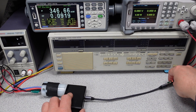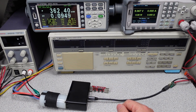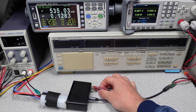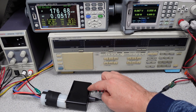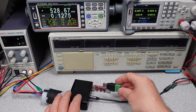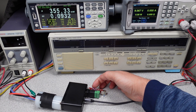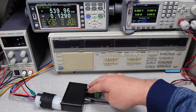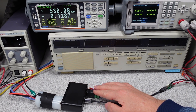Let's check what happens with the USB-A port. I'll turn that to 9 volts again and plug in a USB-A device. In that case it did not reset. The device was able to negotiate its voltage — we have 20 volts right now. It also does 15, 9, and 5 volts. So we get all the voltages out of the QC-capable USB-A ports and they can negotiate their voltage without resetting. When you plug in another USB-A port it does reset those ports, but then it renegotiates back up to 20 volts. It seems like the two USB-C ports negotiate together and the two USB-A ports negotiate together.